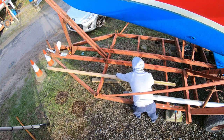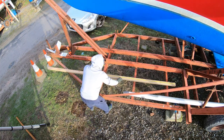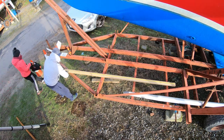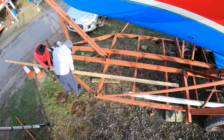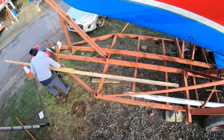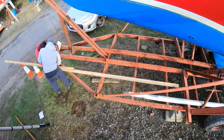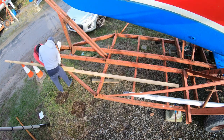So as I said earlier, we've seen online, on YouTube and in a few forums, that the mast could be taken down using a wooden A-frame, and we took some of the measurements that were listed on the forum. We had four lengths of 4.8 meter 2x4 wood, and we used two lengths to make each leg, overlapped by just slightly over 1 meter, which was going to give us the height of the apex just above the spreaders on the mast, and that's where the lifting point was going to be.